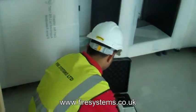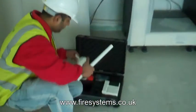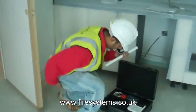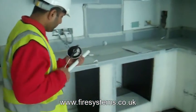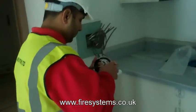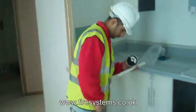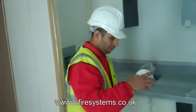I've been asked the question: do you always have to carry out a radio signal strength survey when designing wireless fire alarms? When designing a wireless fire alarm system, some will say it is crucial that you should always carry out a radio signal strength survey. I would agree that carrying out such a survey is important. However, if you have installed many wireless fire alarm systems, as we have, and understand the equipment you are installing, it is not always necessary.